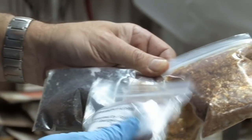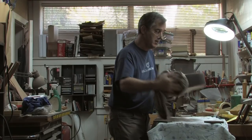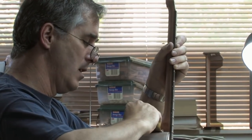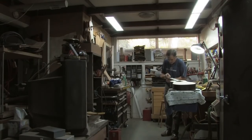French polish is basically shellac flakes that are dissolved in alcohol, applied in small amounts and rubbed continuously until the appropriate level of finish is achieved. The plus of French polish is that it's a very beautiful, warm but still shiny surface that brings out the richness and colors of the wood. The downside is that it's very fragile — basically, as soon as you sweat when you play a guitar finished in French polish, you've ruined the finish.